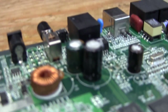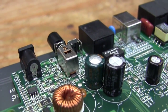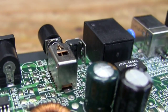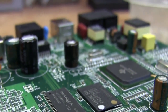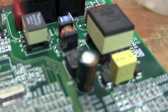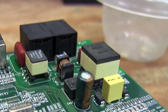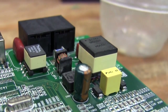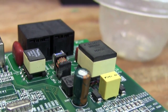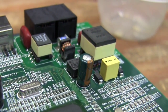See that capacitor right there? The green cap behind the black one right there. The rest of them look okay, but I've got another questionable one right there. It's going to be hard to see with that camera, but that one right there doesn't look any good either. So let me get my ESR meter out and take a look at it.